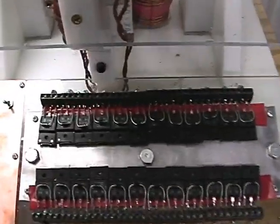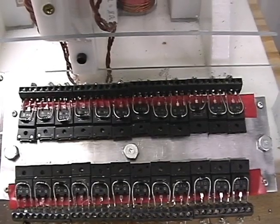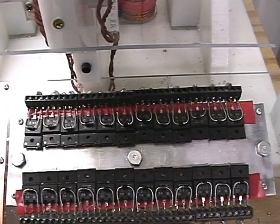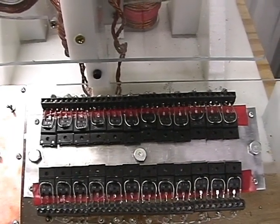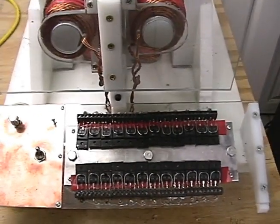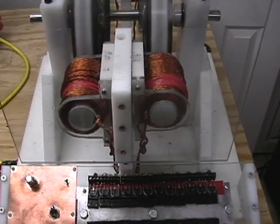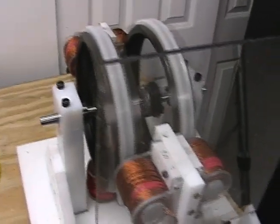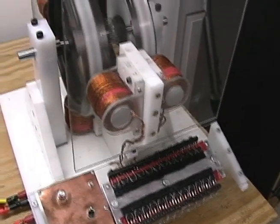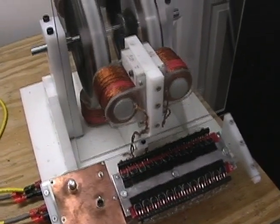The way this is set up, you can change out the chips — the little screws make it easy. The grounds and positives are set up with screws so you can pull each individual one and check ohmage across the input with the switch on, to track down a bad chip. With the motor on, you unhook it, set a meter to read ohms, and a dead chip shows as a dead short. Instead of pulling all the chips, we pull a single wire on each one until we locate the shorted one. That cuts repair time way down — running surplus chips is cheaper than five-dollar chips, so we can run more tests without worrying about frying a set.